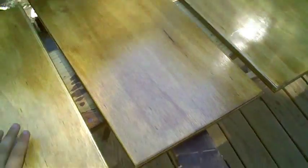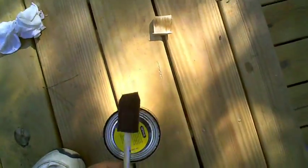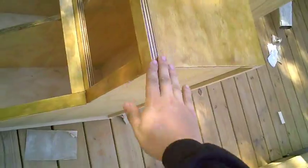Here I got the ones that are going to be kitchen cabinet doors — all the doors. This is the tops; this is actually dry. First I did a coat of polyurethane and that brought up all the burrs. You sand that off and then it becomes really smooth with two more coats of polyurethane — so three altogether but one was sanded off. Real smooth and glass-like. I use foam brushes so I don't leave any trails like with a bristle brush. Very smooth. I stained the bottoms but didn't polyurethane them — just did that in case someone saw the bottoms.